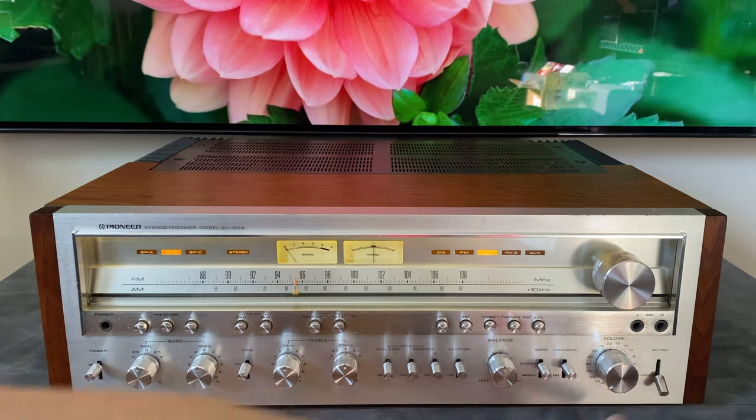located in these little sockets underneath this plate here. Now, that is something that is pretty difficult for a beginner to change. I could see somebody that is just a little bit curious. They can open up the case. They don't really want to do any soldering. You could probably replace these, but you're going to get an inconsistency because the incandescent on the indicators are going to be so dim. So I guess it's a word of warning.